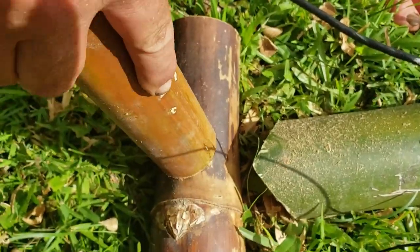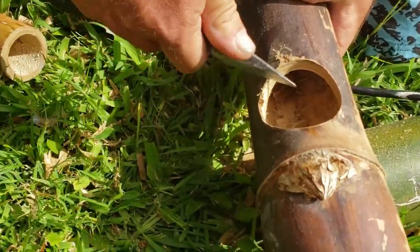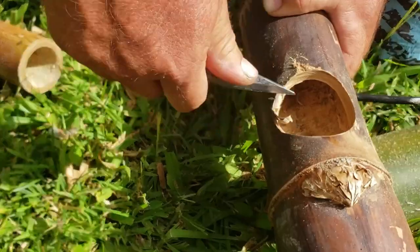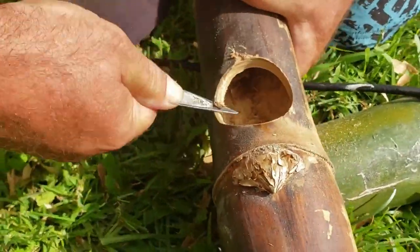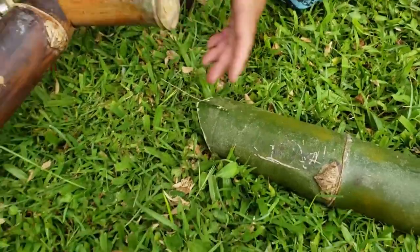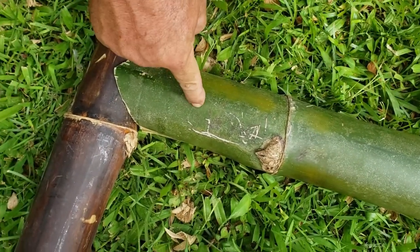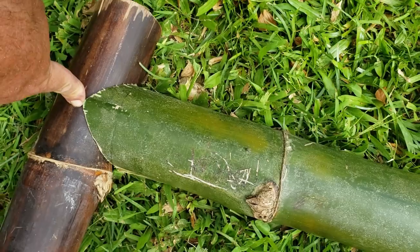We've got to carve it out just a little bit and then it should fit right in. You can see how I made this hole close to a node right here — that's going to give it a lot more strength for our joint. You don't want to have it in the middle of a node because it can collapse. Let's test it out — it fits. So now we're going to fit it into our vertical piece. Then we're going to take this in and fit it into our vertical piece. Perfect fit. And then we want to put a dowel here and then we can put a dowel up here, and this piece will be nice and solid.